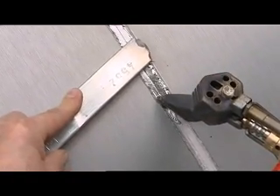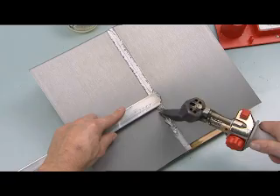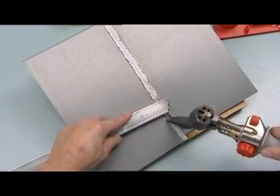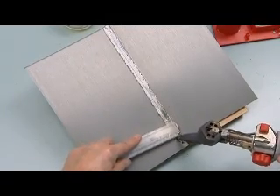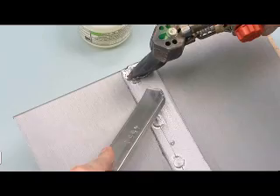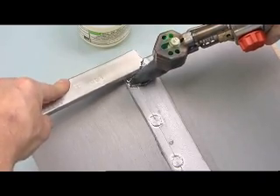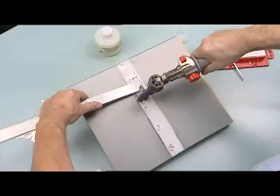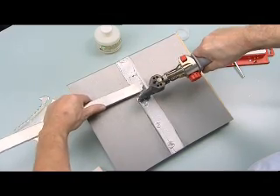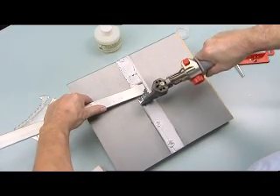After tacking, the roofer can carry out smooth soldering to join small pieces that are not subject to pressure. The quality of soldering depends on the capillary penetration and its adhesion to the parts to be joined, and not on the quantity of soldering metal. Soldering is satisfactory if penetration of the soldering metal reaches 10 millimetres minimum for horizontal joining and 5 millimetres minimum for vertical joining.